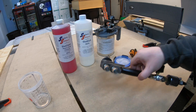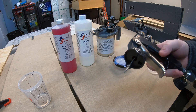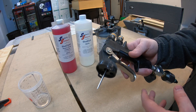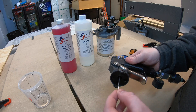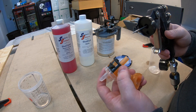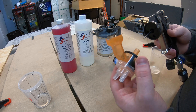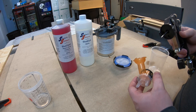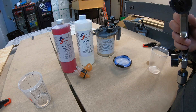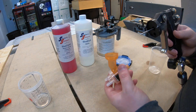As far as my spray gun, I'm using a 3M product — I'll throw the link in the description as well. I don't like spending a lot of time cleaning up afterwards. What's really nice about this gun is the needle stays attached and it's very easy to clean. You also have different nozzle tips you can attach. I'm using a 1.4 millimeter today. They also make 1.2, 1.8, and 2.0, among other sizes, depending on whether you want a heavier coat or a finer spray for paint. It's super easy to change out the nozzle.